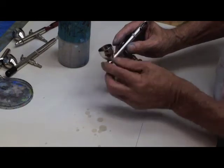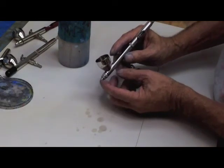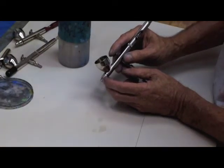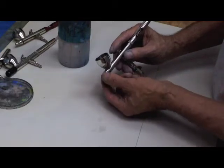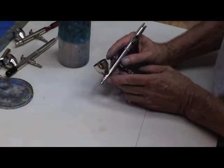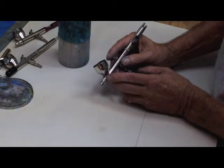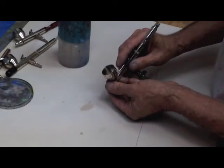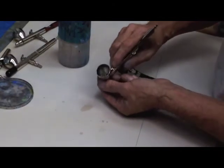There are one of three reasons. One, you have dried paint still inside the nozzle. Or the nozzle is cracked and you didn't pick it up when you cleaned it — you didn't see it. Or you forgot to put this rubber gasket in between the cap and the body, or the gasket isn't tight. So when you push down on the trigger, it bubbles back through the color cup.